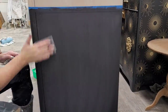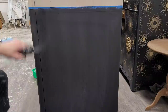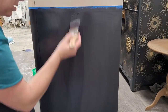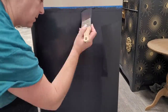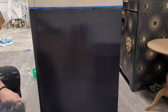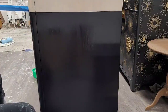With all the faces of my doors covered in a single coat, I made sure I got the sides and edges too. I gave everything a second coat, with a light sanding using a 220-grit sanding sponge in between coats and dusted off using a tack cloth. I'm really paying attention to my brush strokes — nice and long, even, and linear. Black is a really hard color to paint in a solid layer because it will show everything. I'm using a nice soft synthetic bristle brush with a little bit of water. While the paint is still wet, I'm going to pull the tape — it is magical and so satisfying.